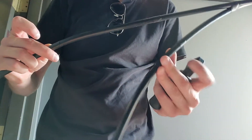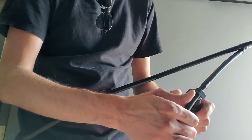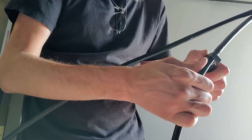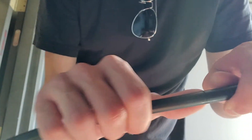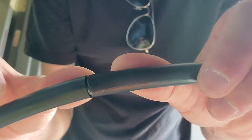Then I'm going to go to the other end of the cable. This side I'm only going to ring one time because that's where I'm going to make my exit of the cable. Just give it a little root — what we should be able to see is a little bit of blue in there. I'm going to do the exact same thing on this side. It looks pretty good; I did not get into the jacket at all.